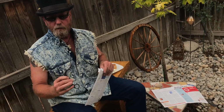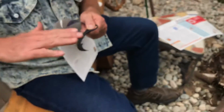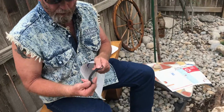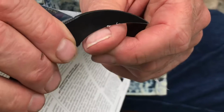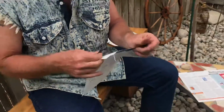And that's actually, it goes from a good 1/8 of an inch wide down to a cutting edge in a half an inch of width. So your primary bevel and your secondary bevel is going to be pretty abrupt to get a cutting edge on it in only a half an inch wide, okay? And that is really starting to bite. Let's see if we can see the thumbnail coming off. Okay, I'm going to hold still right there, and I can see it, so I'm pretty sure you can.